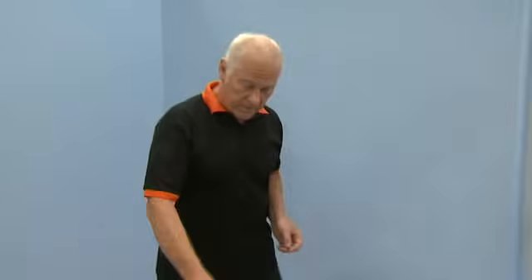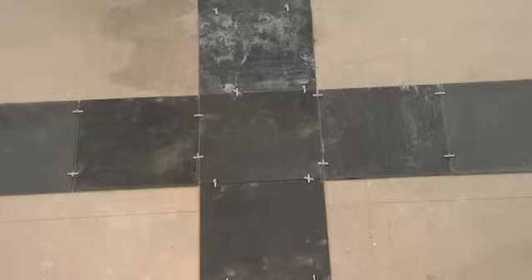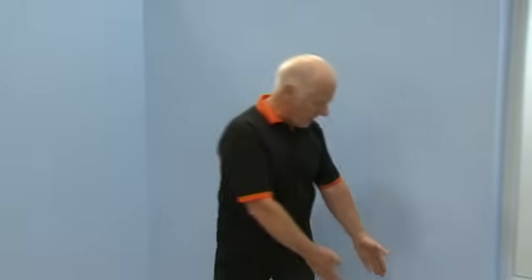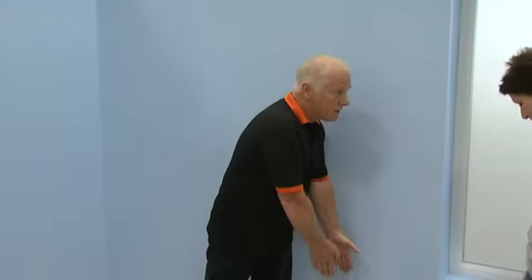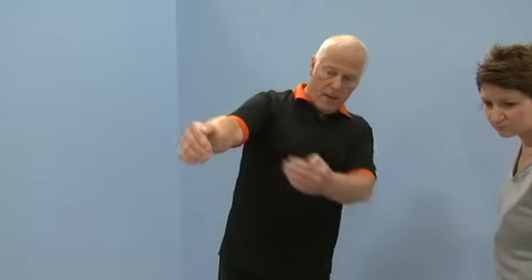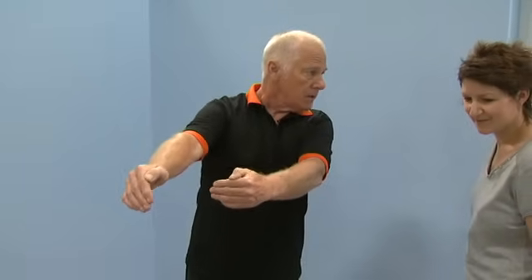So how do we overcome that? By moving the key tile half a tile's width further up. Imagine all the tiles moved up with it and you'll see that will give us a nice broad cut here, and at the opposite end you'll also end up with a nice broad cut — so we balance both sides and both ends, and visually it will look good.